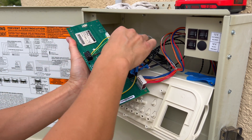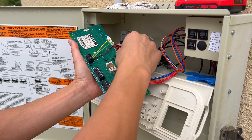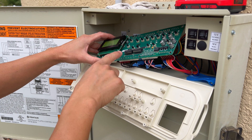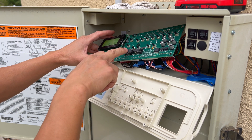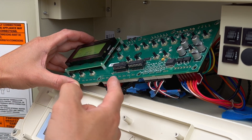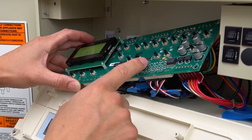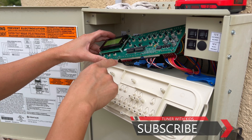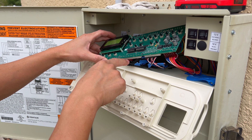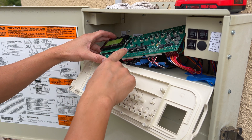All eight outputs on this transistor chip were having the same issues I was seeing. Every relay that isn't being used is clicking on — they're all hot right now. That suggests something is wrong with that chip. There are 16 inputs and outputs being used on this board total, controlled by these two chips. I marked the affected pins in black to track them. Then I swapped the two chips and the problem followed — the same bad outputs moved to my pool pump, light, and blower. My blower came on, my lights came on, and it sent power to my pump, confirming the chip was faulty.